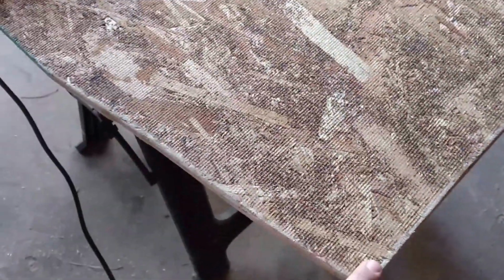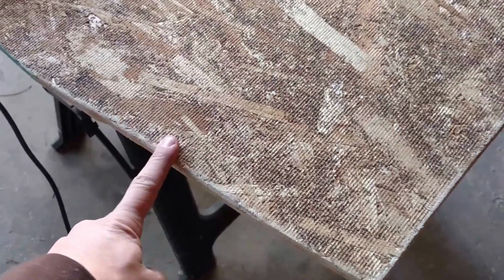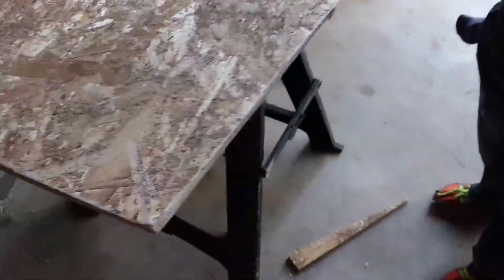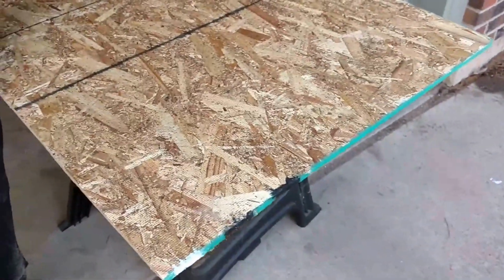So I've started my taper here at the front. Essentially I started about 14 inches from the front, and at 7 inches I went in 1 inch, and then in the back I went in 2 inches, and lined that up on both sides. It's not perfect, but I'm about to insert it in the boat and see where I'm at. On the back side I'm still stock, which is 28 inches wide, so that may or may not fit, but I'm going to slide it in the boat here. I'll let you know how it is.